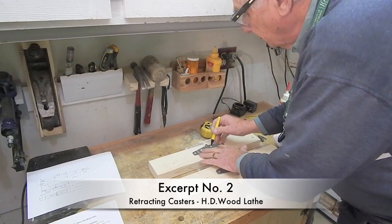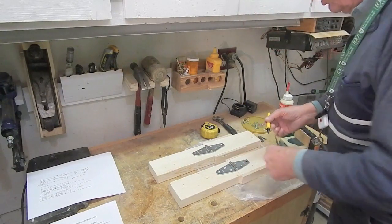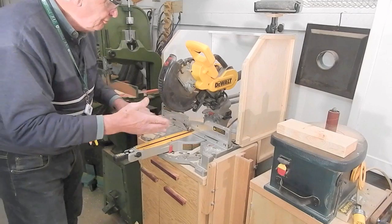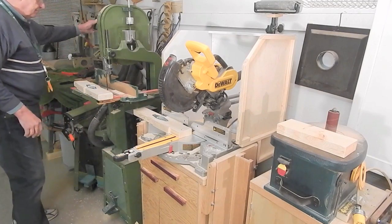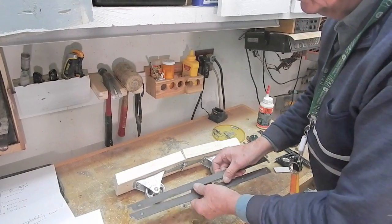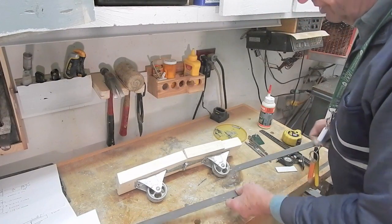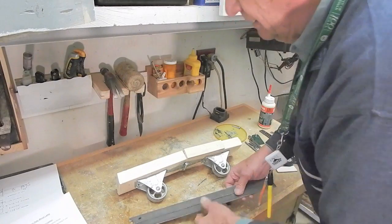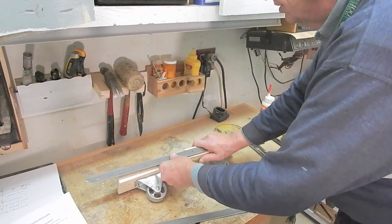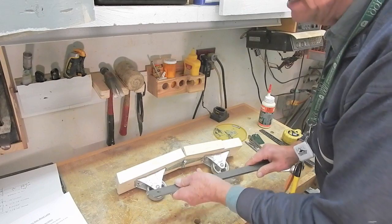Next, I'm going to mark the hinge holes so I can drill the pilot holes for the hinge attachment screws. Cut off the end of the caster mounting blocks at 83 degrees. We need to make two pairs of levers out of 1/8-by-1-inch flat iron. I just bought two 36-inch pieces at the lumber store and cut them in half into 18-inch pieces. Drilled to attach to the rear caster mounting block and drilled at the other end for a pedal pivot bolt — 5/16 inches.